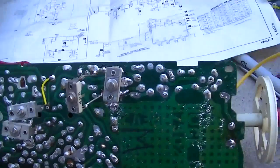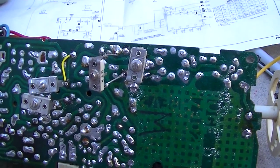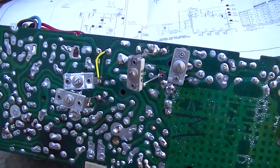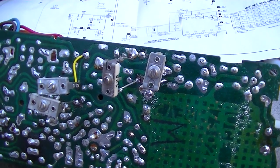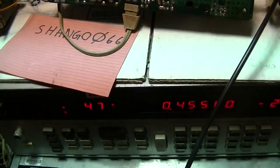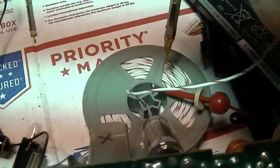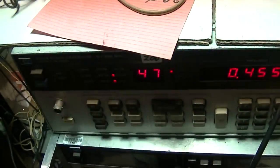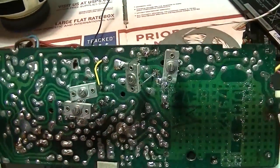Notice how the dial is full of stations now — before it would only get like three or four stations. Let's put it on the signal generator, peak these at 455 kHz, take them off, measure them, put fixed caps in there. I just got it fed into this roll of wire sitting here. Let's do this.